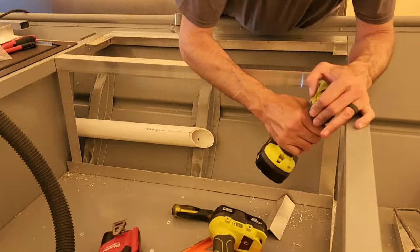I then measured out hydro turf for the front hatch, cut out the odd shape, and then I got that in place. It was time to do some pour foam. This is a two-part mix from US Composites, and it expands when the parts are mixed together. I typically don't use pour foam in my projects, but this was the time and the place for it. It can add buoyancy, rigidity, and insulation.